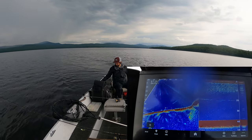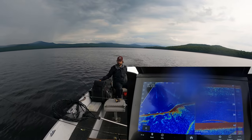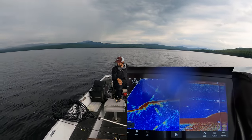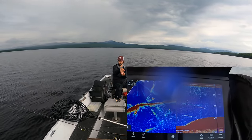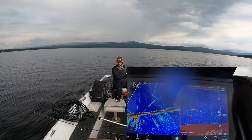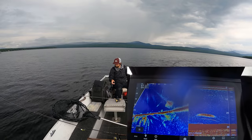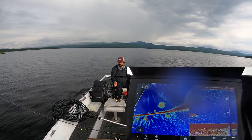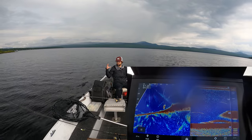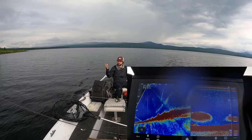There's a pair of them coming up right now — there they are! That's what a standard arch should look like. The reason it looks like an arch is because of the cone: it starts on the front edge, appears as far away, gets darker in the middle as you pass over, and tapers off at the back edge. We just crossed over another one, and one squished down on bottom. Then we drove over a ball of bait — rainbow smelt here in New Hampshire. Ciscoes and alewives will all look like that, with bigger marks for bigger bait.